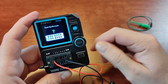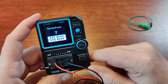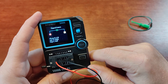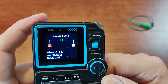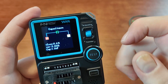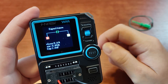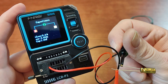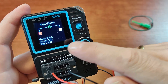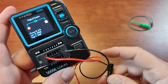If you'll be testing Zener diodes, you need to press this additional button for the higher voltage. It takes some time because it automatically identifies the type of component and displays important parameters. For example, this is a capacitor — it gave us a loss percentage and the equivalent series resistance for this capacitor, which is quite high because it's an electrolytic one, although it's a Nichicon Fine Gold series. And it correctly identifies it as a one microfarad capacitor.